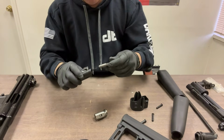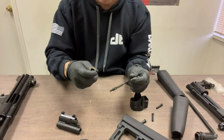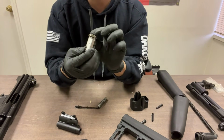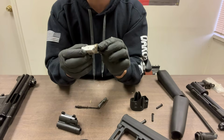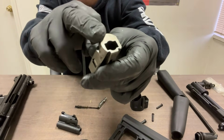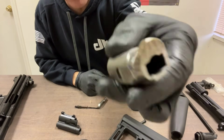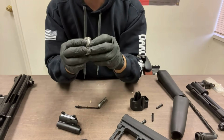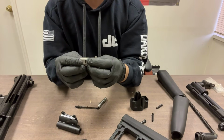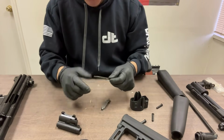So that's that. But the firing pin spring, quality of the carrier, fit and finish quality of the bolt head seem to be good. This particular bolt head, for whatever reason, was probably mismanufactured, so it's got grinding marks on the back, and you can see it's got some color deviation on the back from the heat of it being put up against what looks like a belt grinder. Yeah, can't really comment on that, but overall, it looks like a nice bolt head. Materials I can't comment on either.